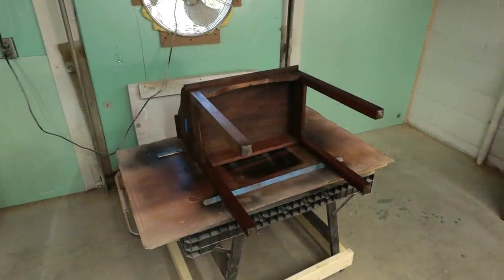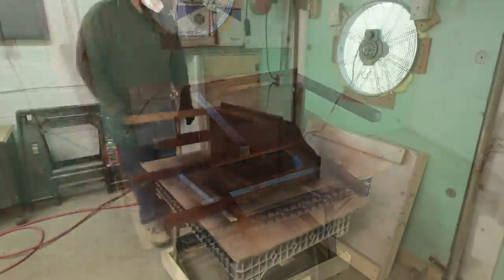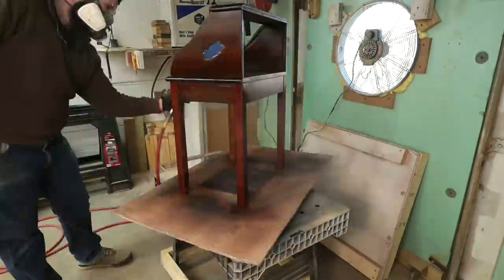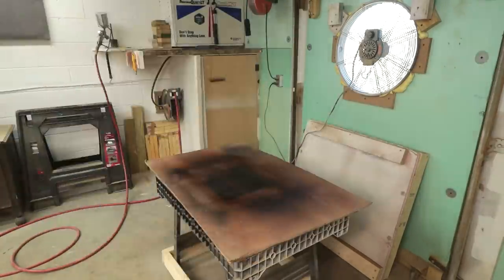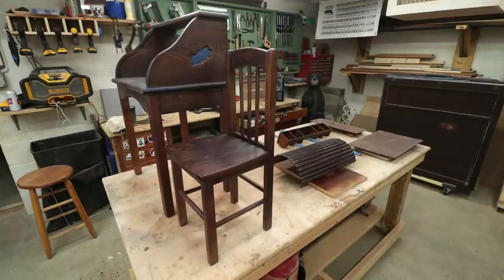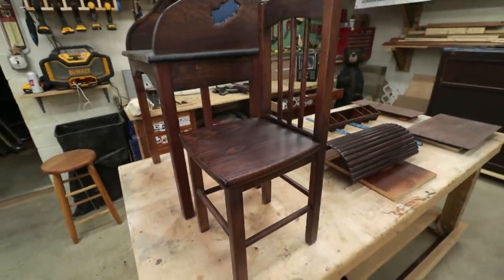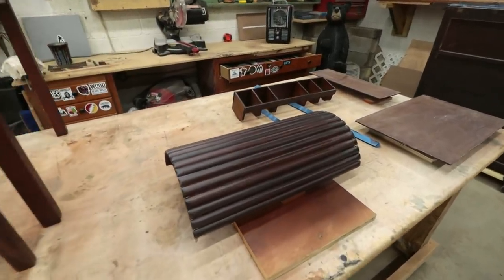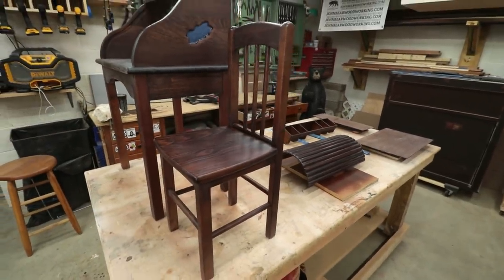Well buds, here we are, all ready for another spray day. Let's lace some lacquer, starting off with that vinyl sealer coat. Got everything sanded up there - smoother than Bucko's belly button. Things look really good. I laid that sealer on pretty heavy so we just smooth it out, spray the dust off, and let's lay the last of that lacquer.